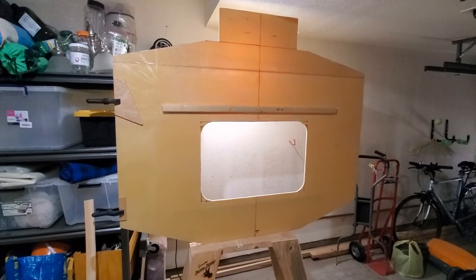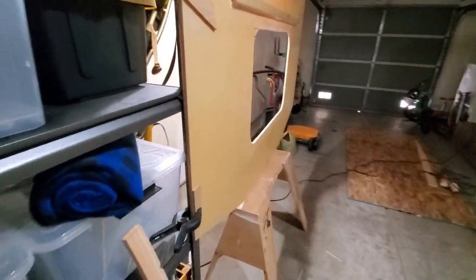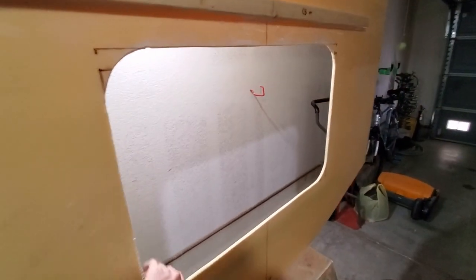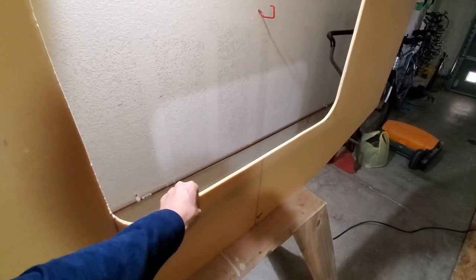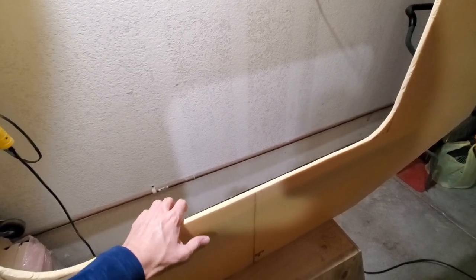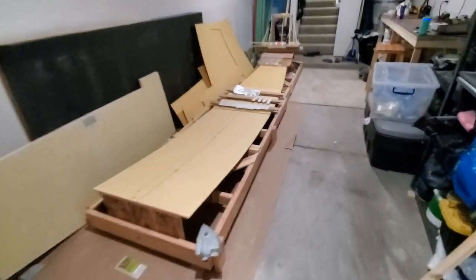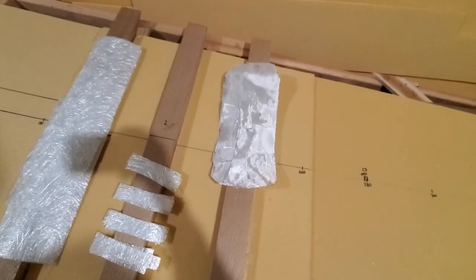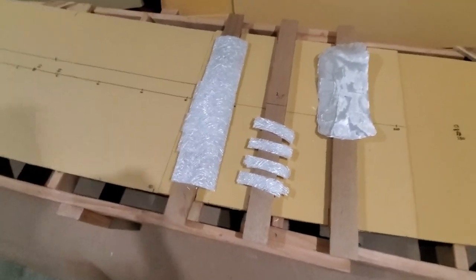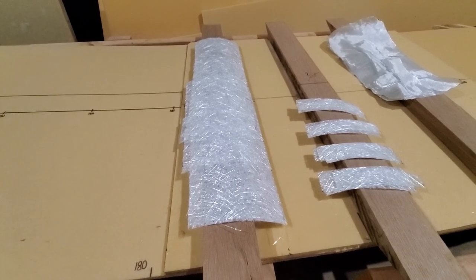I got my main bulkhead here — frame C5 — and I've clamped it up vertically to my steel storage shelf. What I want to do is reinforce this hatch that'll go from the cabin where I'm sleeping to the cargo space. I figure I might sit on this so I wanted to reinforce it so it's a little rounder, more comfortable to grab, and it'll hold weight more. I'm just a little nervous because it's vertical, so it may be hard to lay up. I've got chop strand mat ready to go and then some six ounce cloth to go over that and make it smooth. You're supposed to use polyester resin with this stuff but I just want to use the West System Epoxy I have — let's just see how it works.